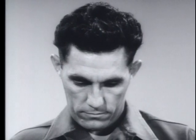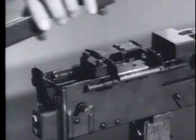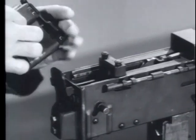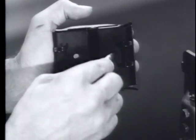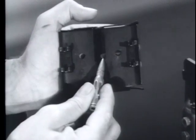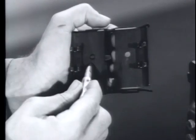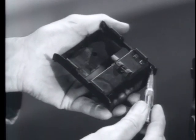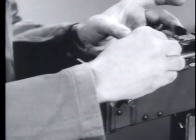To change the feed from left to right, remove the cover and feed tray by pushing in the latch rods on the receiver. Lift the cover off and remove the feed tray. Adjust the feed tray by depressing the plunger and sliding the round stop to the left side of the tray where the plunger engages the locating hole. The feed tray is properly set when the L on the feed tray is adjacent to the L on the round stop. Replace the feed tray.